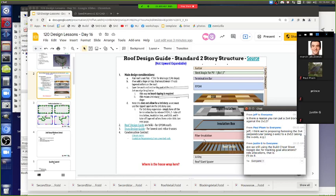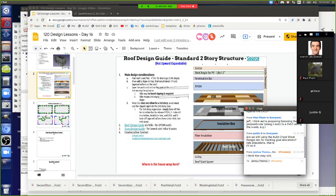So Matt, it's a box that's kind of like what Joshua is doing, except it's all around and it's on top of the roof joists. Now, you don't need to make it positionally correct. All you've got to do is draw this thing to be, once again, the 16 by 32 outer dimension. And make the parts separate: there's your half inch plywood, that's a half inch spacer, and then the 2x4, which is 3.5 inches, so it adds up to 4 inches. I think for you, if you work at the 000 origin, XY plane, that's all you need to do. And then we can move it into place.